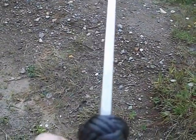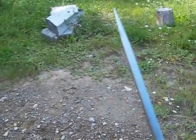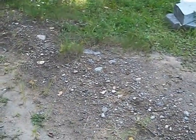So a couple interesting things about the way I ground this sword. I like the look of a lot of distal taper. So as you can see, the spine gets pretty thin back here, but it's actually thicker along that ridge. There's another video I have. So there's 4 helicoidal bevels that help maintain the grind height. So the grind height is at the same height, although there is distal taper, which makes it more agile.